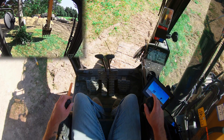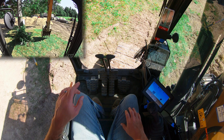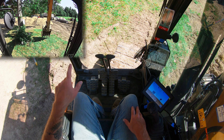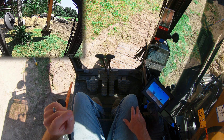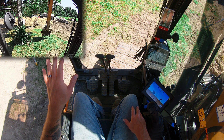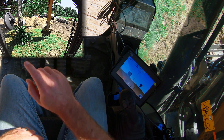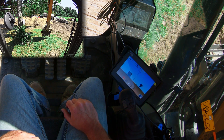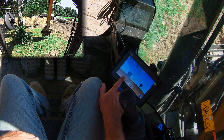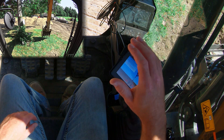I have a line — you're probably not going to be able to see it because of my camera quality — but the height of my tooth on the left-hand side of my bucket is exactly level with the top-of-wall mark on our stake. From top of wall to the bottom of the hole is nine foot five inches. We'll come back to that number. I have my left bucket tooth selected, which is good because that's what I have marking as a benchmark.